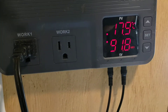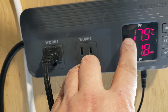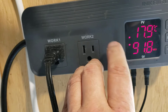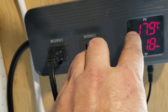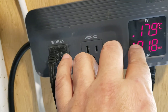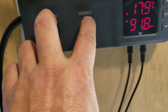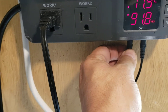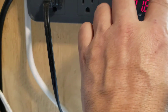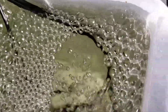At a glance you can tell what's going on. These two lights are lit up; there's a light here that's not lit up and a light down there that's not lit up. On the temperature side, that light being there means this is adding heat, and this light here means that's dehumidifying — removing humidity. When the sensor on this side, be it temperature or humidity, is in operation — in this case it's temperature because you can see it's degree C — we can follow that all the way down to a probe going in the water.